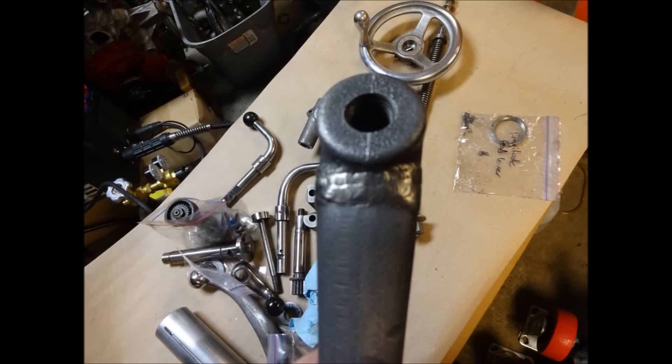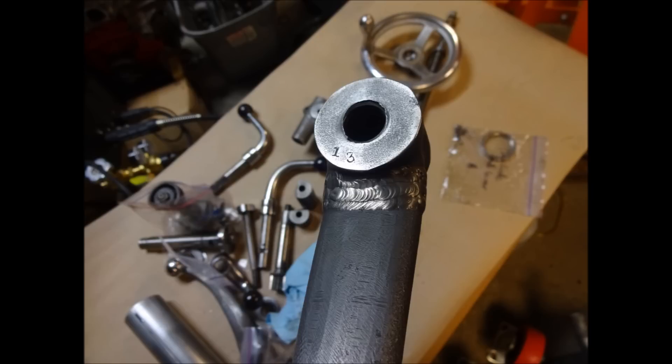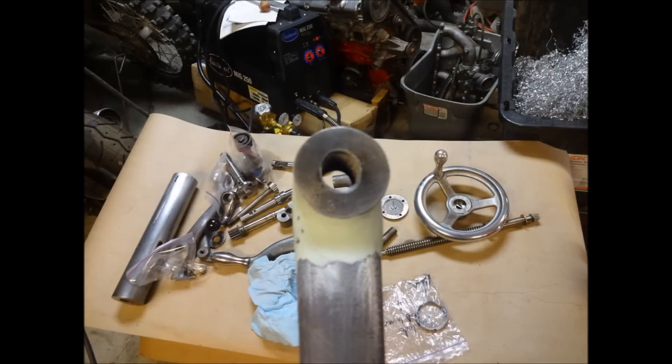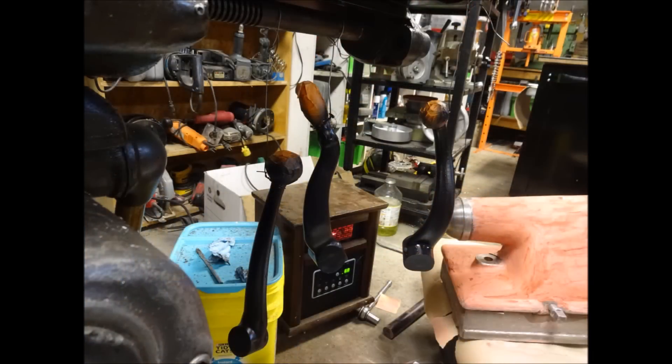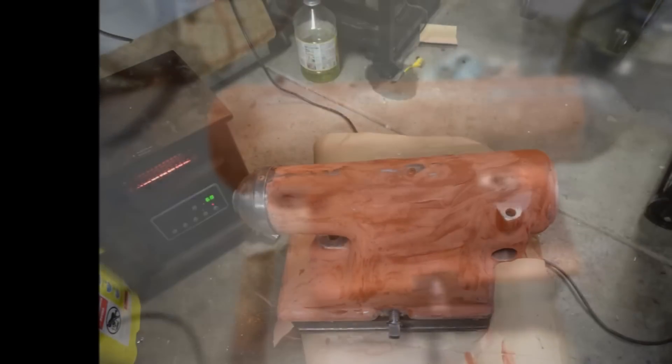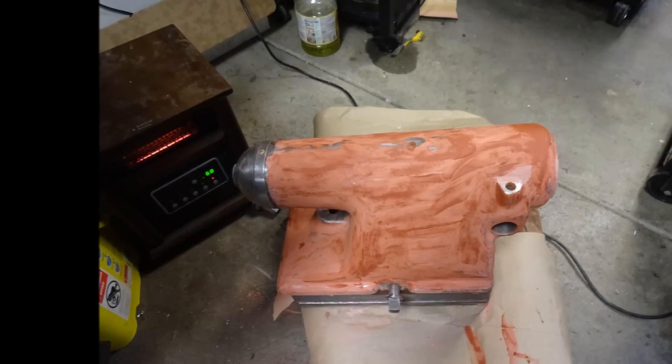Here's the handle for the lock on the tailstock. You can see someone did a nice nickel arc repair on it. I did a little bondo work on it and made it look good. Here are the handles after I got them all painted, and here's the tailstock all bondoed and ready to go — actually I hadn't finished sanding it there, but here it is with the paint on it, parts polished, back on the lathe.